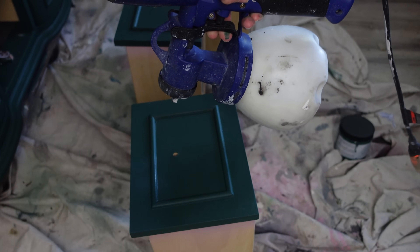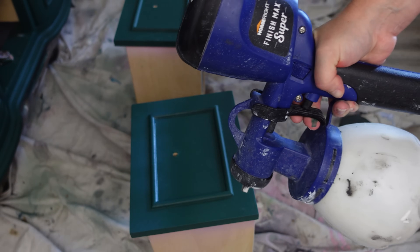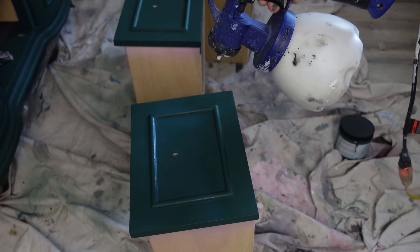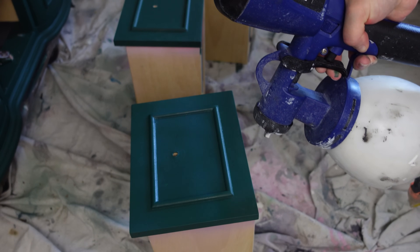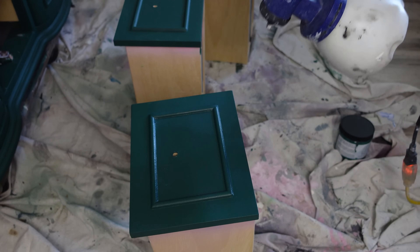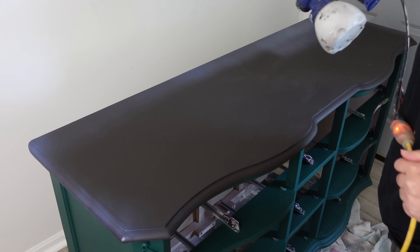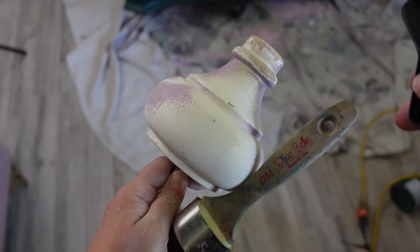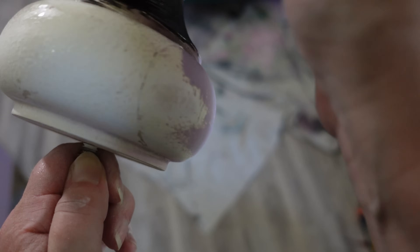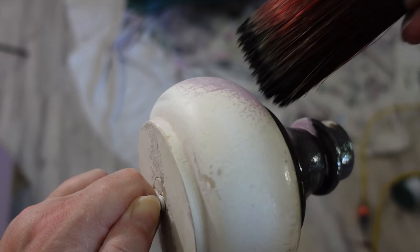Once I have my transfer on, I want to seal the piece. I'm using Dixie Belle's clear coat in satin. I use my sprayer for the clear coat because I don't want streaks — it's so easy to apply with the sprayer, even indoors. I applied a total of three coats of sealer on the entire piece including the top. I waited about two hours between coats — that's pretty important. You don't want to put your sealer on while it's still wet; you want to let it dry and make sure everything is hard and good before applying the next coat. Then I remembered I didn't even paint the feet, so I used Coffee Bean — two coats, waited for it to dry, sprayed them, and put them right back on.